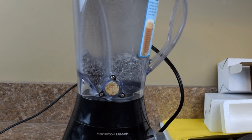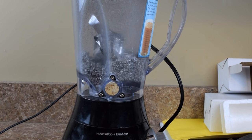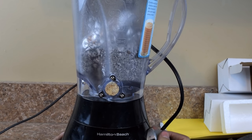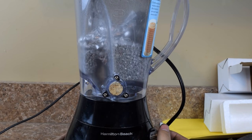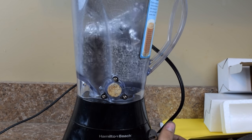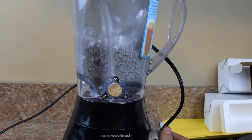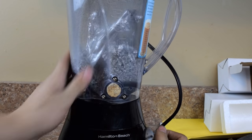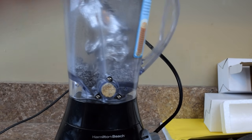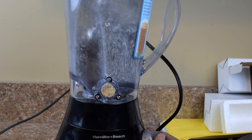That is because, like iron and many other metals that can spark when cut or struck, aluminum is known as being pyrophoric. In other words, it can ignite spontaneously in contact with air so long as it has enough surface area to rapidly oxidize. We won't be getting the particles that fine, but the dust floating around the air can still ignite and deflagrate or even explode if subjected to an open flame or stray spark — a phenomenon known as a dust explosion. So before opening your blender lid, let the blender cup sit undisturbed for at least 30 seconds to let any aluminum dust settle before opening.